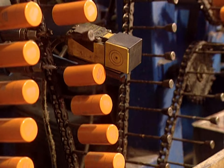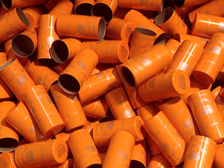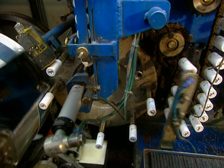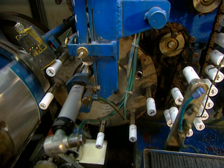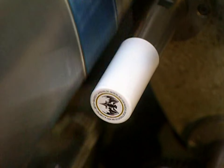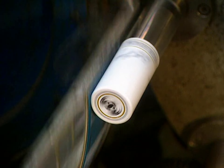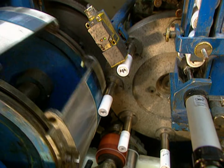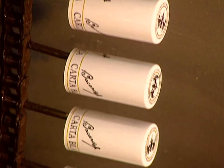The dried caps are ejected and fall into a container. This other flexographic-type decorator prints 155 caps a minute. We can clearly see the ink roller, which imprints the side of the caps as they rotate against it in a steady stream.